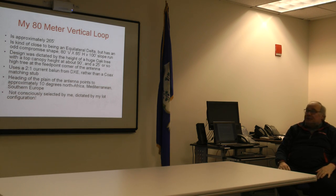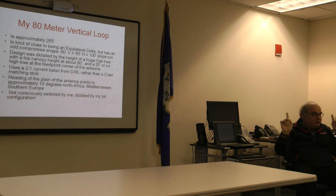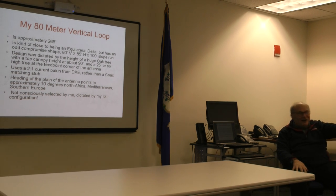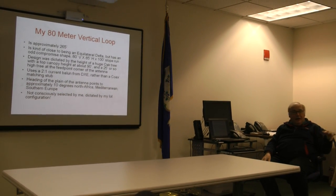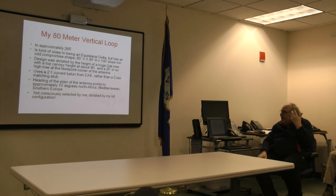If you want to make the stub assemblies using the RG59 coax, maybe budget $40 for the parts. So about half the cost. More flexibility with the balun, but understand too, I wanted to run 2 kilowatts PEP. I was unsure. 1.5 kilowatts. Well, I'm just using the old terminology. But a full size, full capability, without having to worry about frying the RG59. I didn't want to shell out money for RG11. That's all. So, in a way, the balun costs a few extra bucks, but it does the trick.